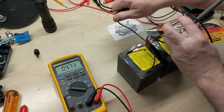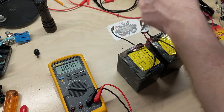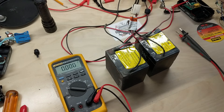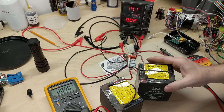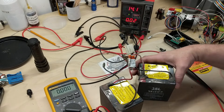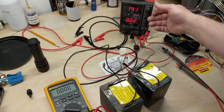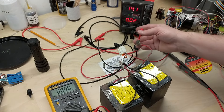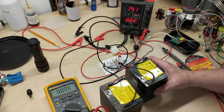The other one is under five volts. What I can do is carefully monitor a power supply hooked up and see if the batteries will hold a charge. With the batteries pulled down to way below half voltage — close to a third of voltage — it's apparent the batteries are probably discharged beyond saving. The one that had six volts I got hooked up to about 14 volts of charge, and we only see about 20 milliamps showing, so very little charging is happening.